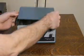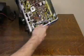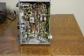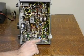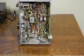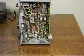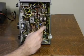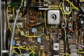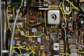Removing the top cover, you can see that most of the circuitry is on a single-sided printed circuit board. There's a small second PCB for the audio amplifier and some point-to-point wiring to the front and rear panel controls and connectors. There are internal trimmer pots for setting the transmit-receive delay and side tone volume. Note the use of toroid inductors, which was a relatively new innovation at the time this radio was made and not seen on older equipment. Assembly did not require the kit builder to wind any of the toroids.